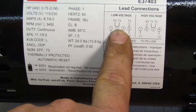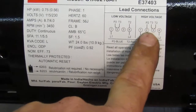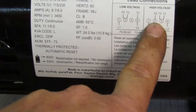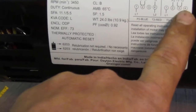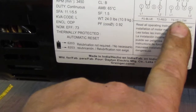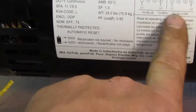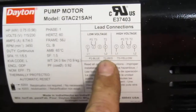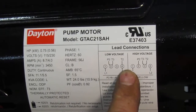When it comes in, T3 is on number three and it gets moved to number two. T2 is on number three and it moves to number four. Again, T3 is yellow and T2 is red. All we have to do is move the yellow and the red wire, and watch the numbers that are associated with it.